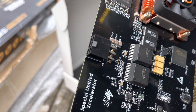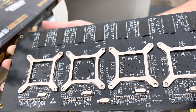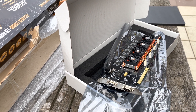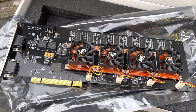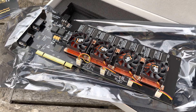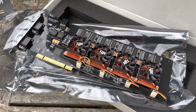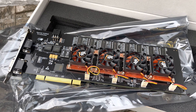It looks like it's got five nanosecond RAM on it, so it may be overclocked on the GPU. These are not the revision 320s, which were the last of the VSA-100 chips — this is just the 220. But it may be able to be overclocked. I'm more interested in four times or eight times anti-aliasing and higher framerates in Quake 3 and Unreal Tournament. Anyway, that's a quick unboxing. Let's test it in a machine — I'll see you next time.